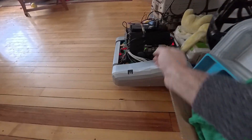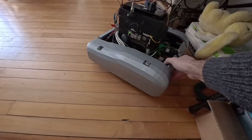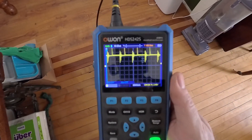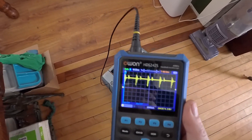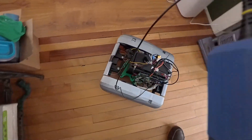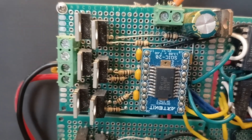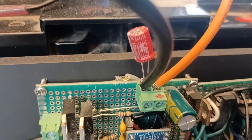As I ran the robot, there were also times when the motors would kind of stall out and make a humming sound. I started to investigate with my handheld oscilloscope, and after probing some points I found it was simply noise on the input power rail of the motor controllers. I didn't think this should affect anything since the gate drive rail was fine, but it must have been playing havoc with the bootstrap circuitry for the high-side MOSFET. A simple 100 microfarad capacitor fixed the problem.